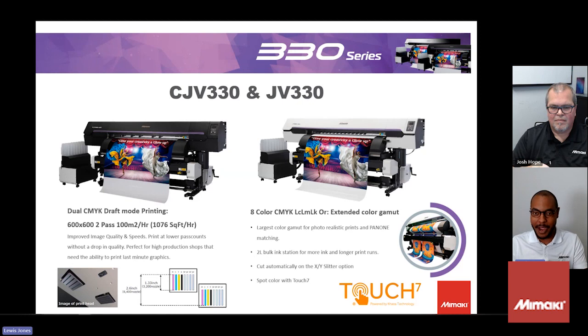We were running dual CMYK, showing off the super draft mode. And on the JV, we were running 8 colors, so CMYK, light cyan, light magenta, light black, and orange, showing that extended color gamut for people who really want their colors to pop or really want to do advanced color matching. We had some really colorful graphics that were made to pop with Touch 7 software. We were cutting those on the XY slitter. That's an option on both the CJV and JV now.